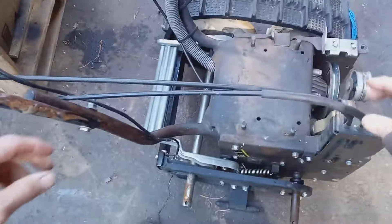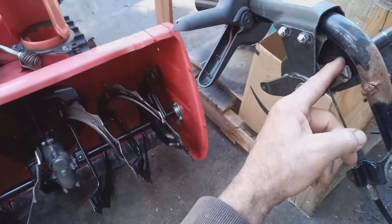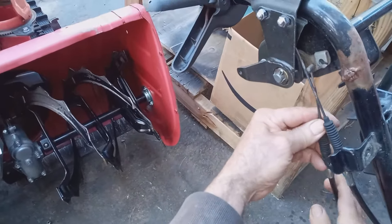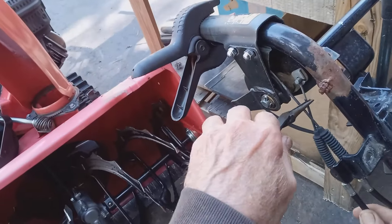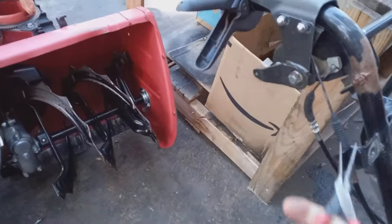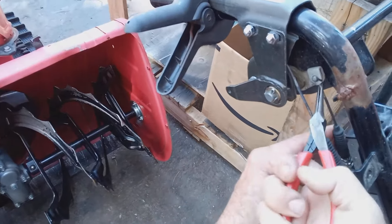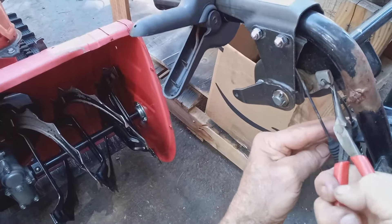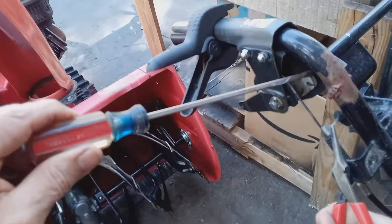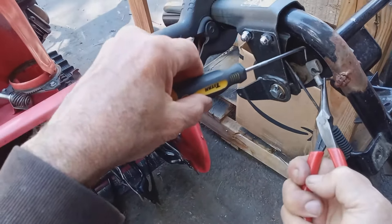Now up here, this is the drive cable. What I did was I locked down the auger cable so this pulls forward — you see. And this goes in here like this, and then you use needle nose pliers to pull it out. You see how it's in there now. So you want to keep this lubricated. To pull it out, all you have to do is get some needle nose pliers, grab it up here, and pull it out. Sometimes you need a little bit of back pressure, so I'll use a pick or a screwdriver — a pick actually works good to push on the back side of this to pull it out.